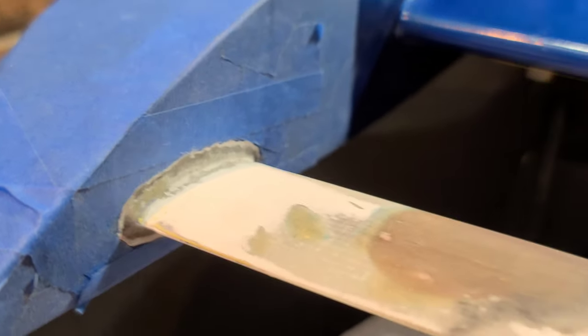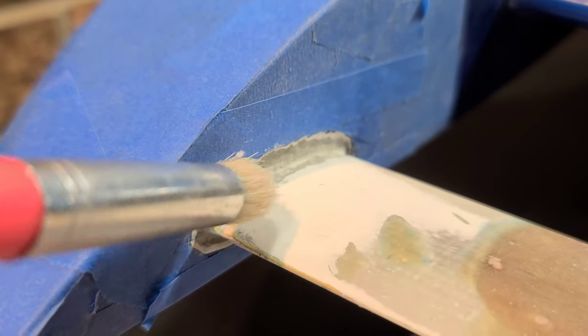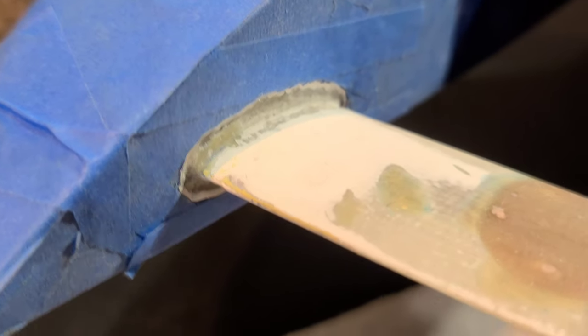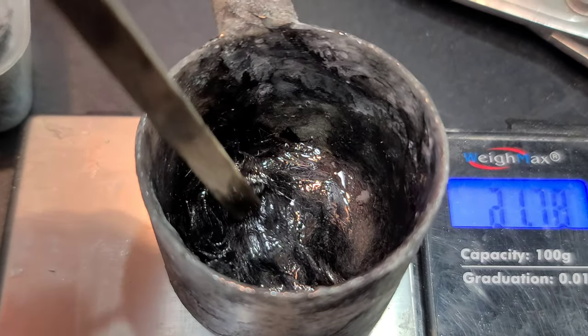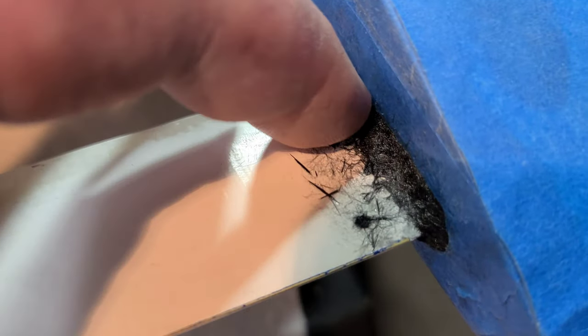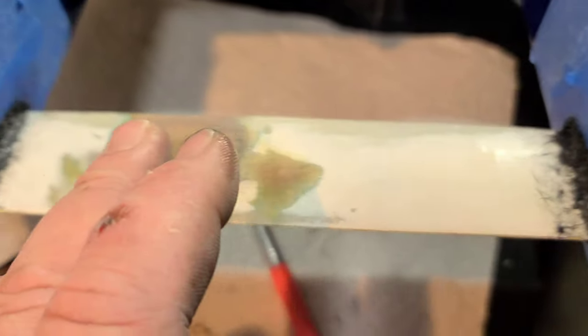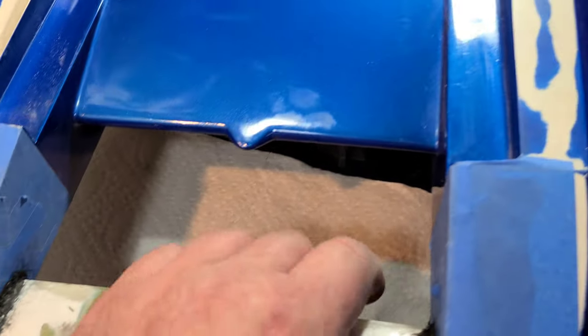I got it feathered top and bottom on both sides. I'm really glad I did this because when I touched the grinder to this little area, a big chunk just kind of fell out. I got it down to some good fiberglass, feathered it to my tape. Basically all of that will be chopped-up carbon fiber and epoxy — it made a kind of thick mixture. I got that whole void filled where I feathered around the winglet, the little canard up here. Got it nicely shaped, nice layup, and that'll set us up for the carbon fiber cloth across the winglet so we don't have a terrible-looking transition from the winglet to the hull.